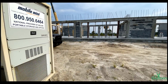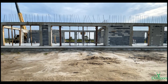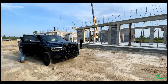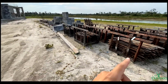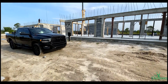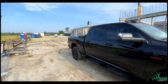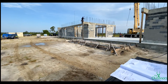Today we're going to go ahead and place the joists up here. Monday we'll be back because it's supposed to rain and there may be lightning today. So today we're just going to lift them up, place them where they're supposed to be, and put the roll bars in at the spacing called for in the layout. Then two days later we'll come back and start anchoring them, putting the plywood and fill paper, and pouring. I'll bring you guys along for all of it.